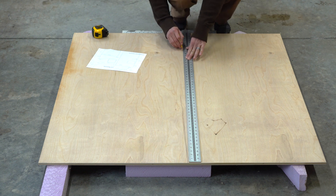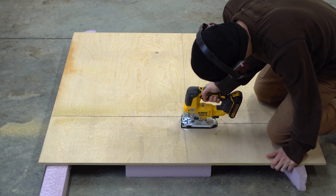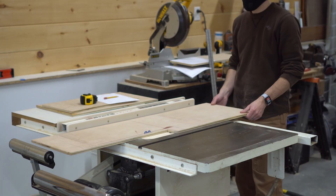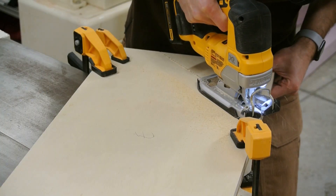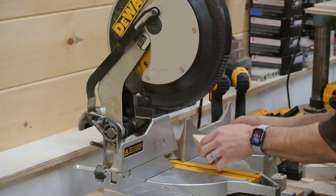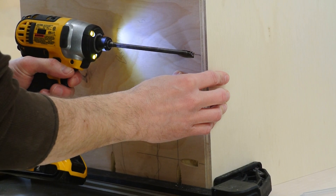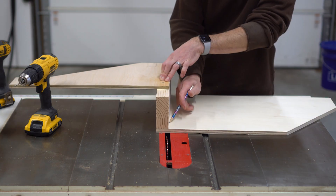Let's get started working on the base by breaking down half a sheet of plywood. I'm doing a quick bit of layout and using my circular saw and jigsaw to remove an oversized piece that I'll turn into the large side piece of the base. Then I can head over to the table saw to cut all of the other pieces. Most of the pieces are simple rectangles, so they can be ripped pretty easily. But when it comes time to cut the large side piece, I make two different passes from either direction and then finish up the shoulder cut with my jigsaw. Now with both of the side pieces clamped together, I can make the contoured cuts. The last thing I do is cut the spacer and gusset that I need for the offset side — I rip a 2x6 down to size and then cut the pieces at the miter saw. Now I can start thinking about assembly. I'm using pocket screws to hold everything together and taking a moment to sand all of the pieces now as it will be much more difficult after they're assembled.